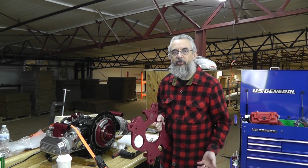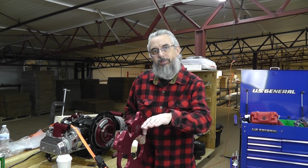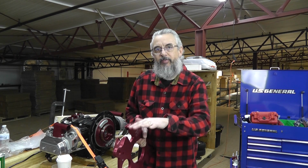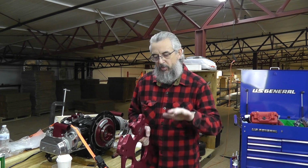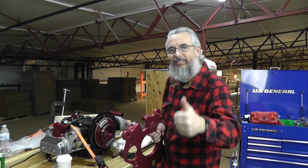And obviously that's on wheels and going to roll around, so I'm thinking about rolling it over to the edge of the mezzanine here and getting the fork truck, bringing it downstairs into the warehouse floor. And then I think I can put my fork truck blades across the bottom feet of the engine stand. That should hold it more than stationary. And then it's just a matter of whether I can exert 227 foot-pounds of torque on that gland nut or not. So that's the plan. Wish me luck and follow along.